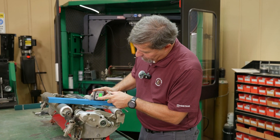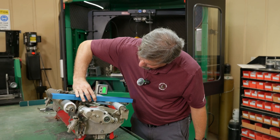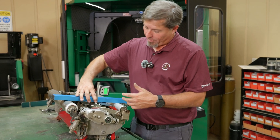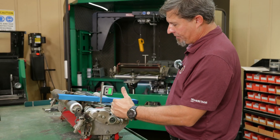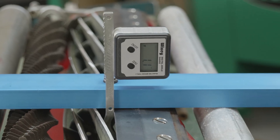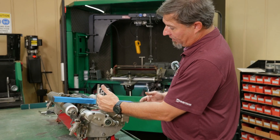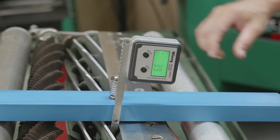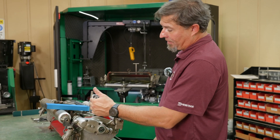I'm going to zero my gauge again. The reading is 1.2 — and the confusing part here is this is actually the other way. If we look down the center line of the reel, we can tell that the BC Master is pointed forward. Normally it's pointed towards the bed knife, but in this case it's pointed forward. So we're close to 60 thousandths in front of center.